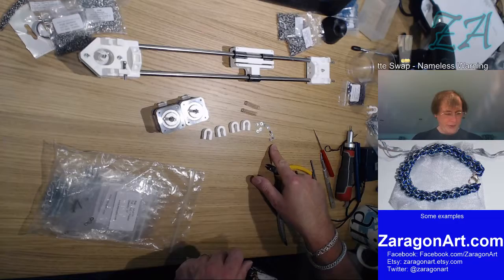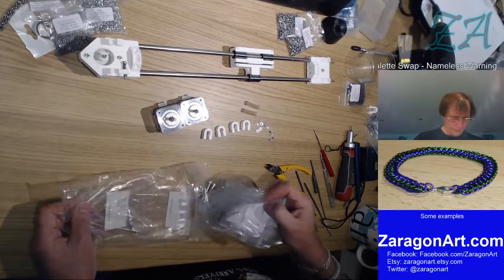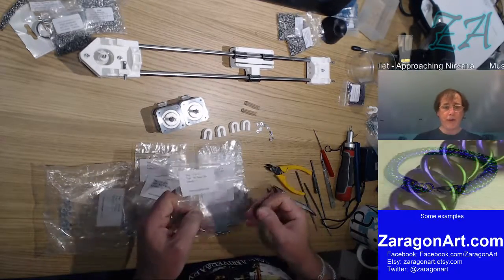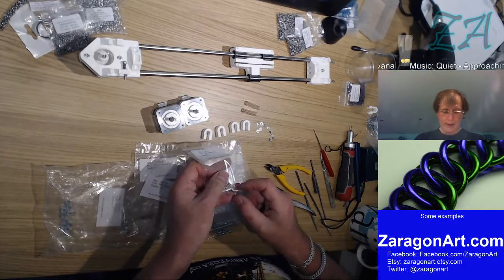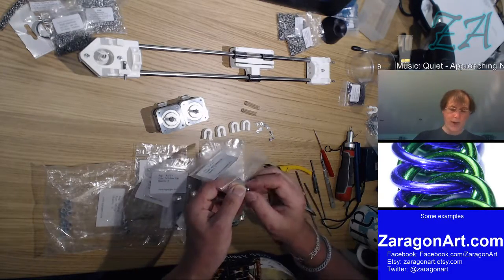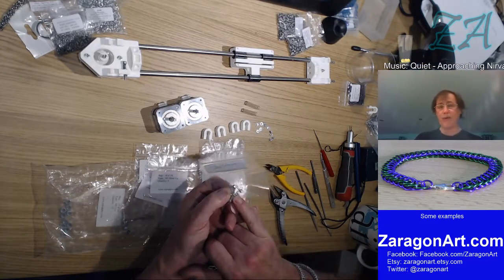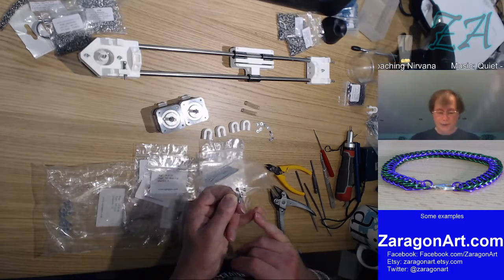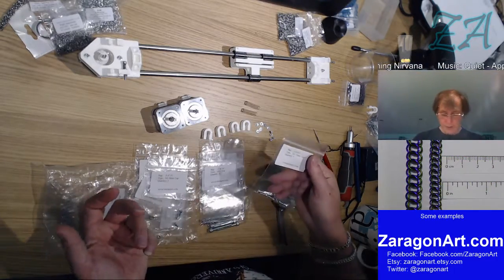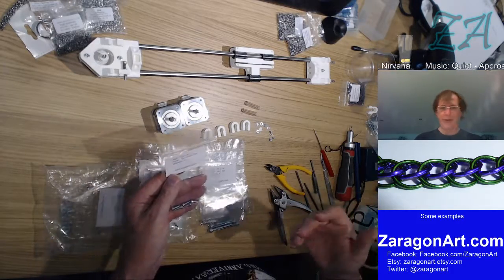Right, four nuts, M3 cap head screws. Okay. So with these things, the M means metric. The 3 refers to 3mm, which is usually the thread diameter. And then the cap head refers to this sort of square top with a hexagonal hole in the middle, which you then use a hex wrench, otherwise known as an Allen key. But an Allen key is a trade name. So in theory, you should only use an Allen key if it's come from the Allen company. Everybody else, it's like Hoovers. That's a trade name, but everybody calls them Hoovers. They're actually a vacuum cleaner.